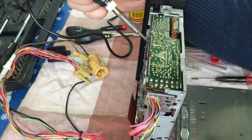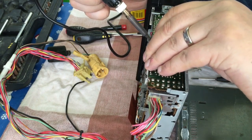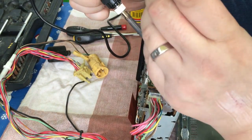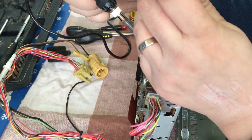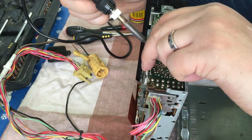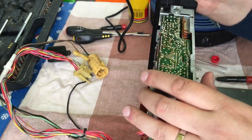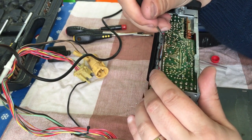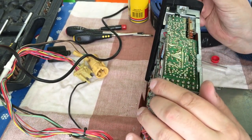At the top of the picture you can see six solder points that connect to the main combined on/off volume, fader and balance switch. I used some electrical contact cleaner and went over that switch. I also went over all of the boards with contact cleaner, as there was quite a lot of brown resin-like residue which can sometimes become conductive, so I mopped it up with a tissue to make sure everything was clean.